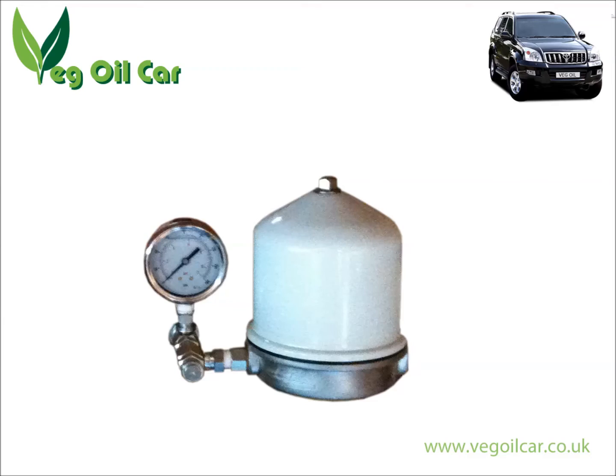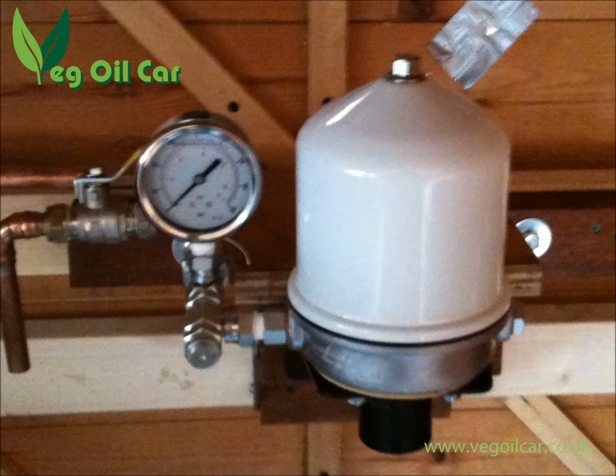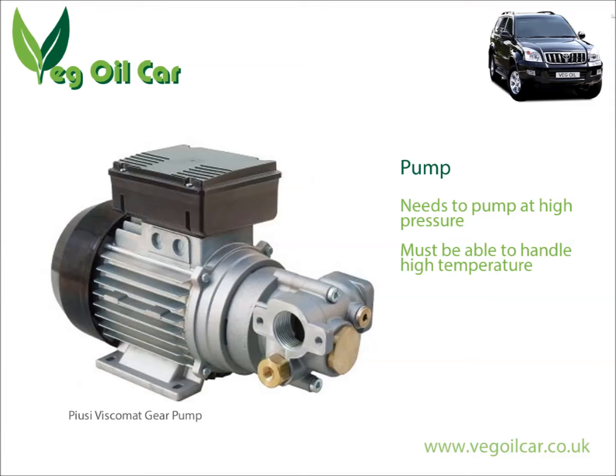So what does a typical centrifuge setup look like? The obvious place to begin is the centrifuge itself. This usually isn't the most expensive part, but you do want to spend a bit of money on it — don't go too cheap. If they're too cheaply manufactured they can be off-balanced, and when they spin they'll rattle like mad and just won't work nicely. But the heart and soul of any centrifugal filtering system is the pump. The pump jets out the oil at high pressure, so you're looking at a sophisticated pump — not the sort of thing you'd use in your garden.